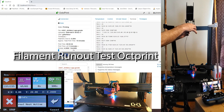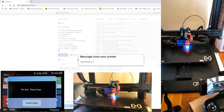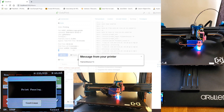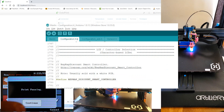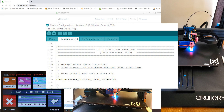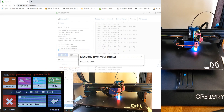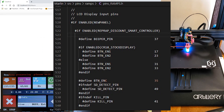Any suggestions about how to make this process smoother and more streamlined, please let me know in the comments. Let's dive into the changes I made in Marlin and then talk about what I did in the TFT to handle host prompt support. The first change I made was to enable an LCD controller in Configuration.h. I chose RepRap Discount Smart Controller, but it really isn't that important because we aren't using an encoder or any of the LCD menus — my only consideration was avoiding pins that might conflict with something already installed on the board.